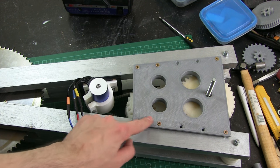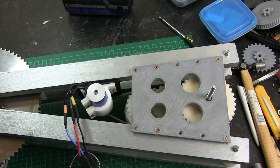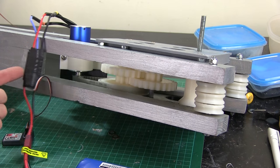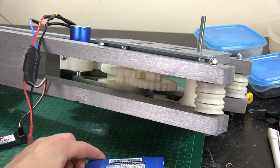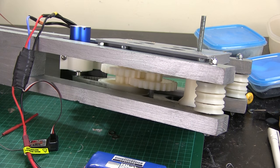I've put the gearbox together inside here. I've also got the motor fitted on this plastic bracket, which is only for testing — obviously the motor does get warm and ABS isn't the best material. That's attached with the drive belt. It's hooked up to the same old motor driver which is one for a quadcopter at 30 amps, and it only goes in one direction. I've got a lipo, an RC receiver, and a radio control handset — same as in part one. So now I can actually power this up.